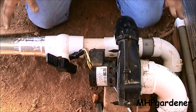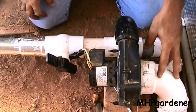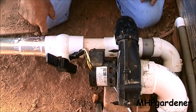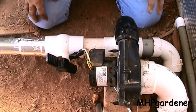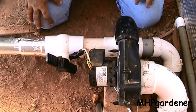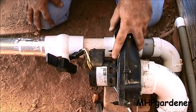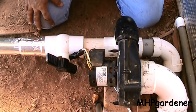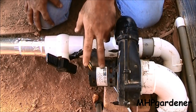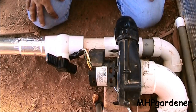This is what makes the whole thing go: the blower, the air intake, and pulling air from the outside. The two-inch line goes into the bottom of the stove. This blower came off of a gas furnace. I hooked it up last winter the first time and found out it was way too strong — I had to figure out a way to throttle it back. I hooked it up on variable speed and just didn't like it. I didn't feel like it was a good idea to try and throttle this motor back, so I had to do something different.